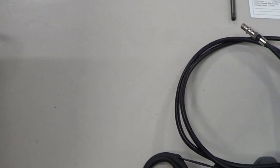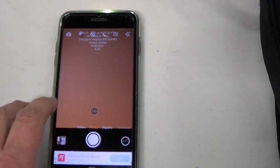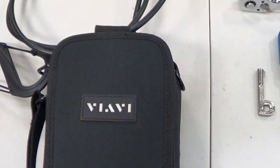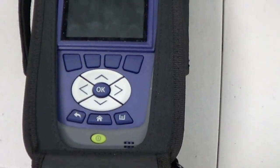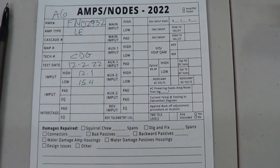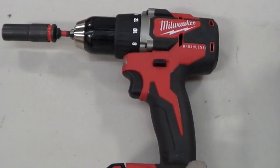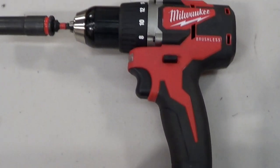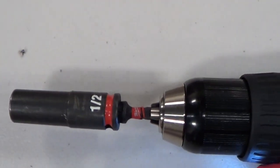I'm going to show you all the tools that you need in order to do this job properly. You need a cell phone with the timestamp application, the VIAVI meter — in this case a ONX 630 meter — a test jumper, an F81 barrel, the amp card for documentation, a pen to fill out the information, and a screw gun with a half-inch socket on it.